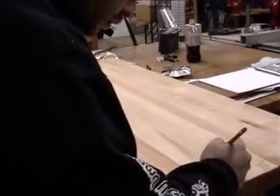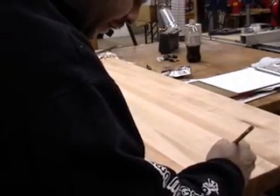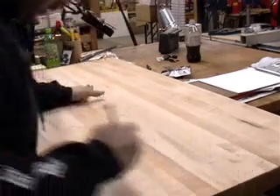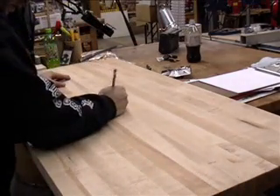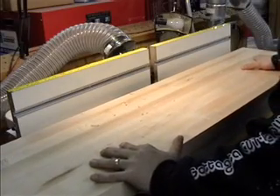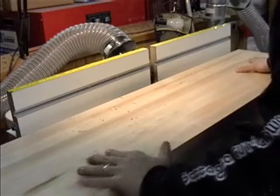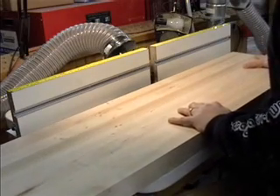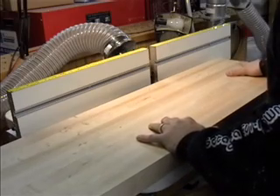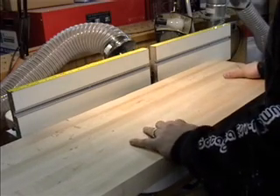Now it is time to mark your board. Mark your boards for face up, also mark the edge you'd like to join, where you'll be cutting your biscuit slot, as well as starting and stopping points for your biscuit slot. Because the countertop will be trimmed down, I do not want to run the slot out of the end. I want to stop a few inches short and give myself room to trim it down — this way there will be no slot showing in the end grain.